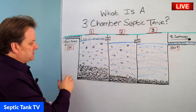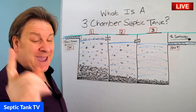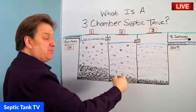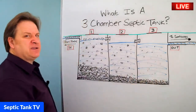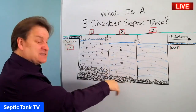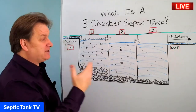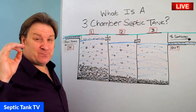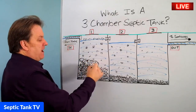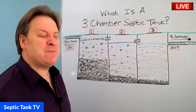Now, one more thing I was going to say to you, with all this fat and the grease and the sludge in there, when they come to empty the system, a lot of septic tank emptying people will only open or lift the lid of the third chamber. Why? Because it's mostly water and they can suck out that bit of sludge. If you're lucky, they will also open or lift the lid of the second chamber and suck that sludge out. But I had a guy ring me last week, and this is typical of everyone with a septic tank with three chambers. 99% of septic tank emptying people will not empty the first tank, because if you haven't had your tank emptied for like, flaming hell, 5 years, 10 years or whatever, and it's full up or at least half full with sludge, it's a nightmare for septic tank emptying companies to suck out.